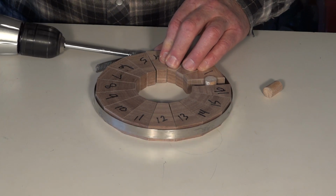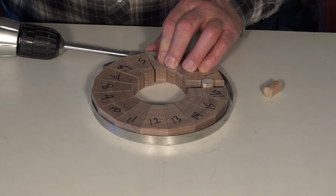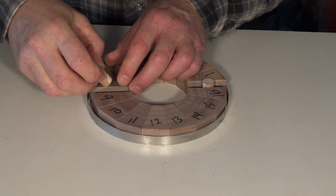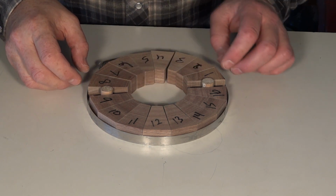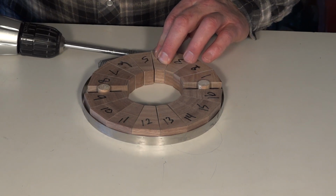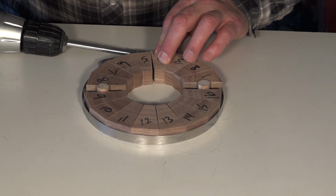To use the half ring method, just put a piece of dowel between segments on opposite sides of the ring. When you tighten the hose clamp, the dowels will allow the halves of the ring to swivel a bit, and this will cause the other joints to tighten up. Once you have done a dry fit to be sure it works, you can glue the other segments.